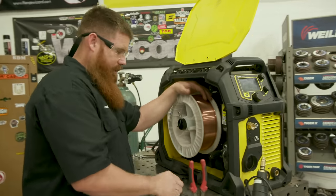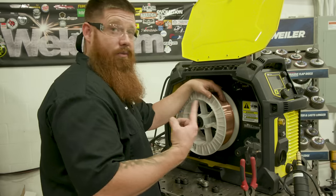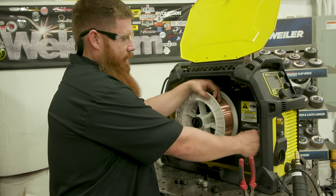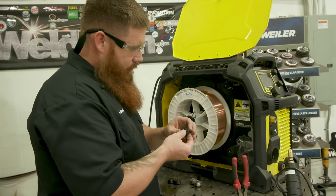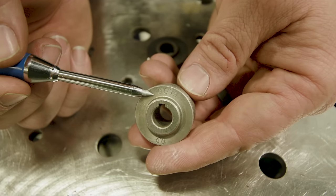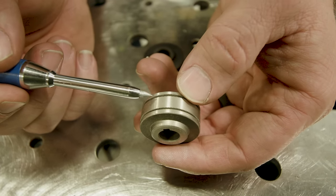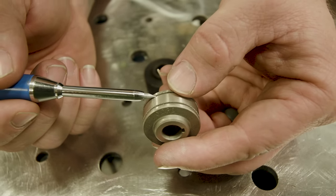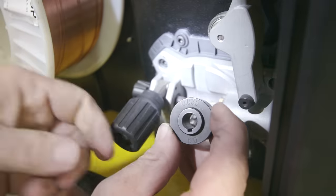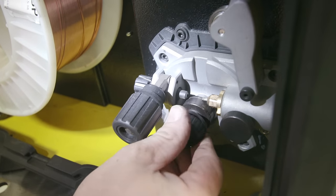Select the appropriate drive rolls. This machine only has a single drive roll, so I only need one on the bottom with a universal wheel up top. I'm running 035 wire — 70S6 Select Arc. Make sure you have the 035 groove. On this wheel there are two different grooves, and 035 is written closest to the smaller groove, but that's actually the 0.024 groove — the labels are written on the opposite side from where they are. So when you put it on the drive roll assembly, 035 written facing you means that's the groove in use.